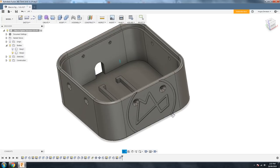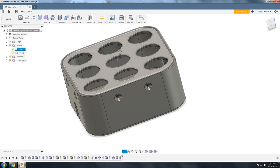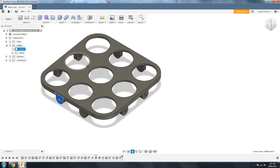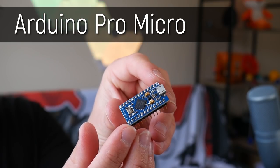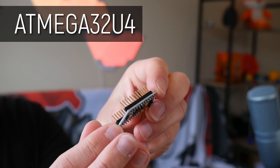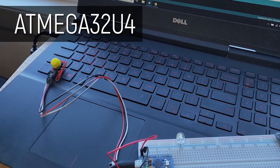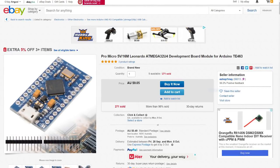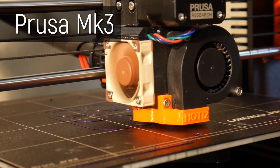This is version one. I figured that a three-by-three grid — so nine buttons — was enough for my use case. I didn't need four-by-four, although you could change this for more or fewer buttons depending on your situation. I did some research into how to emulate keyboard presses with an Arduino, and it turns out you can do it with an Arduino Pro Micro running a ATmega32u4, which can emulate the USB input of a keyboard or mouse. They're also very cheap, which is fantastic for keeping the budget of this project low.